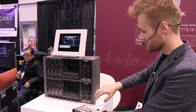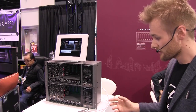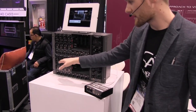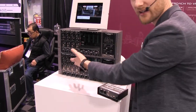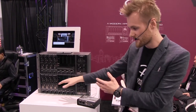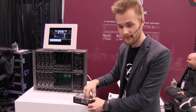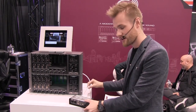By doing that, we can position one box in the vocal booth and the other in your control room. Sling out this box with CAT5 anywhere you want it to be, and now mic line inputs that you put in here will travel up the cable and arrive directly at the inputs of the modules — just flick the switch over to receive the CAT option. That's a really quick way of receiving mic inputs located externally. And secondly, at the same time on the same cable, the monitor mix you're listening to on the box is sent back through the cable and straight to the headphone output here. That includes your talkback as well, so you can communicate with your singer, send them a headphone mix, all using just one cable — all analog, zero latency.